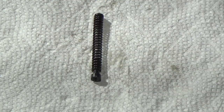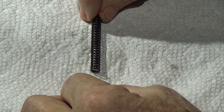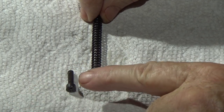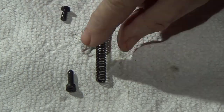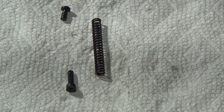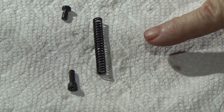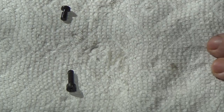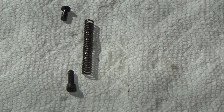Let's take this apart slowly. This piece has a T-shape with a cup on top; the other piece is pointed like an arrow. The spring is the same on either end, so you can't get it wrong. We're going to take out that way-too-heavy spring and bring in the new Wolf 18-pound reduced spring.